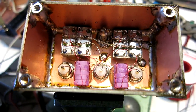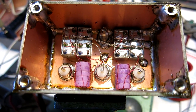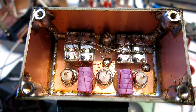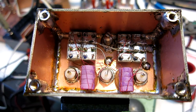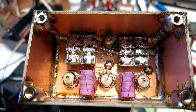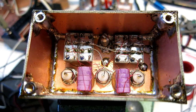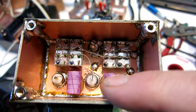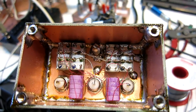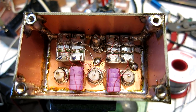To increase the power handling capacity, I have made this level 29 Schottky diode mixer by connecting four level 23 mixers in parallel — 2×2 — and those two parallels in series for the output, but in parallel for the inputs. That means the input impedance is 12 ohms, so I have transformers here for the local oscillator and for the RF. The output — two units in parallel is 25 ohms, and those 25 ohms in series means 50 ohms for the output.